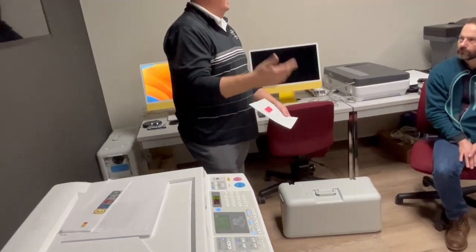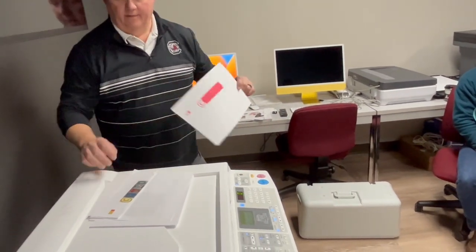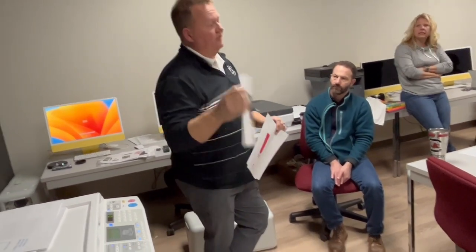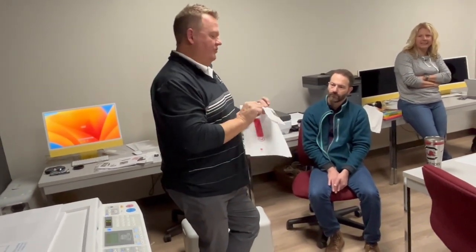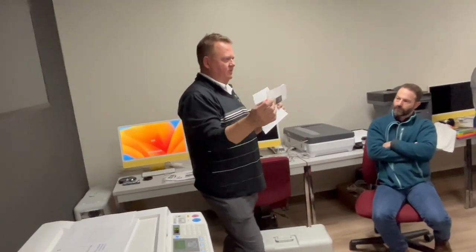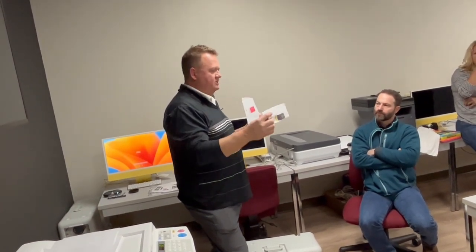If you get something that starts off but then lightens back up, that's the ink not flowing — it's from sitting idle. Keep in mind this is a very low-tech machine. If you print off a fancy original with lots of gradients, you're going to get a blended image. Think of it like a stamp. I would not put photo backgrounds on prints — maybe simple screens instead. The quality won't be magazine-level, so keep designs simple.